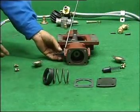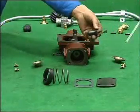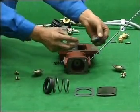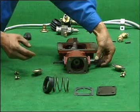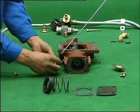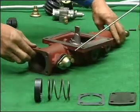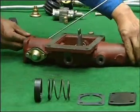Use the lubricating oil when mounting the cylinder plug. Put it into the housing and mount spring into the hole of cylinder plug. Put on a gasket. Fix spring pressing slate onto the housing with bolts. Mount the opposite cylinder plug with the same approach.